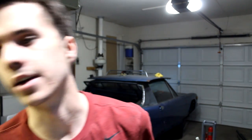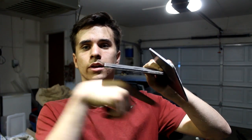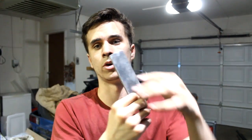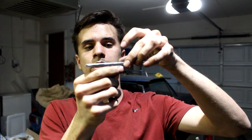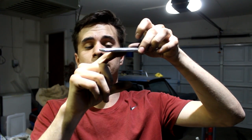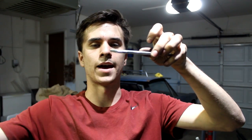My plan is to have tubing coming out of the plate at an angle. For the smaller front ones, I'm going to take a piece of tubing, go straight down off of it about an inch and a half, and then have another piece of tubing attached at basically a 90 degree angle. So my next step is to make sure the bolt holes are right, drill them out, and confirm they mount on the car okay.